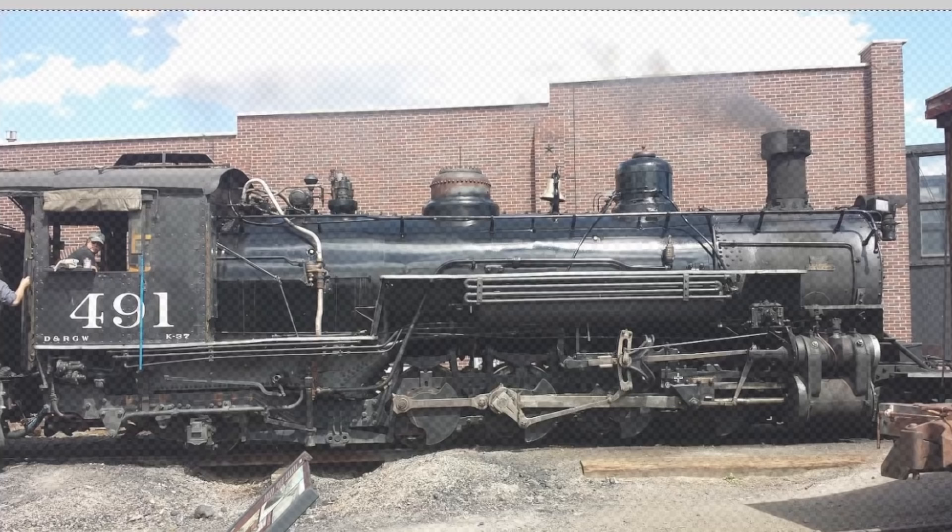The rest of this stuff is what we call valve gear, because the primary purpose of all these rods — other than the driving ones — is to move the valve. In the case of 491, from the outside the valve looks very similar to the main cylinder and piston, but on the inside it's quite different, with two different sets of seals in something that looks like a dog bone. You have seals on the left and right sides, and you can put steam in the middle, and as you move the valve left and right you can pick which channel the steam goes down.